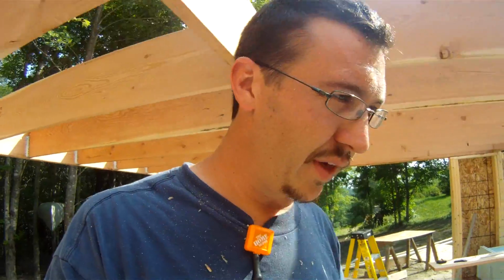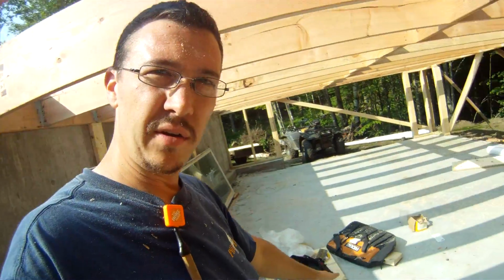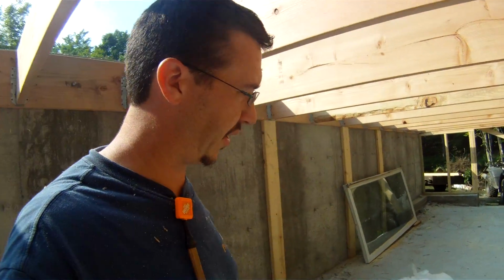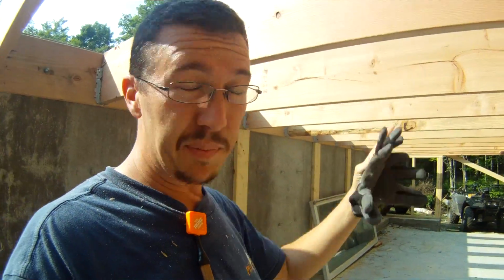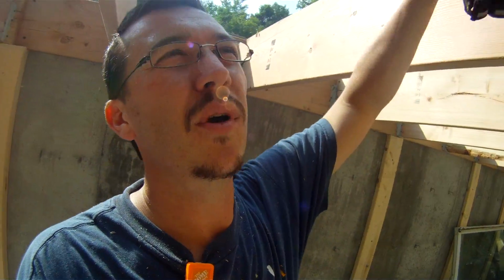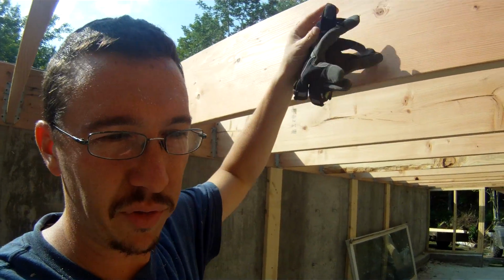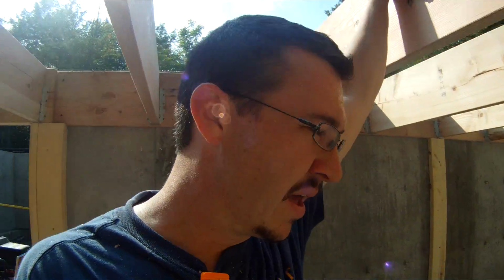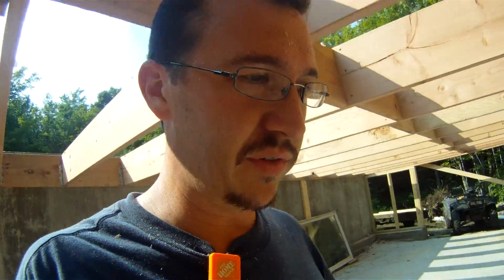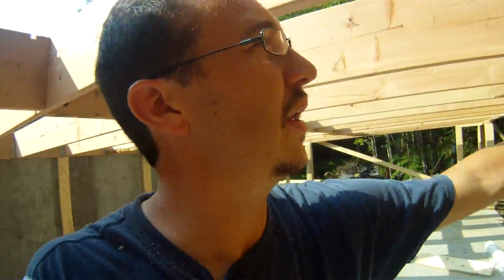So I was driving the other day, and I had this thought: you can put radiant PEX in slab on grade installation, that's fine. And then you can do the staple up for in between joists. And then you can also do on top of the floor, you can run it once you already have a floor there and put sand etc. Well, I was thinking I'm going to need to staple this up, and I'm going to need to drill all these joists and then fish all the PEX through the holes and do that whole thing.